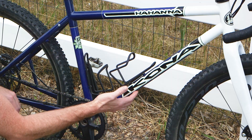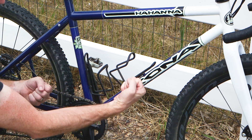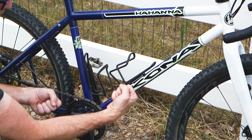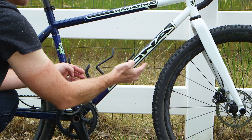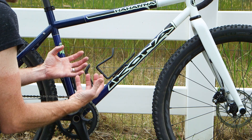Where it does weaken this tube is in torsion. As this tube is twisted, having these slots in the side increases the risk that it will buckle. The greatest torsional forces on this down tube are in the center, so placing the slots at the ends should minimize that risk.